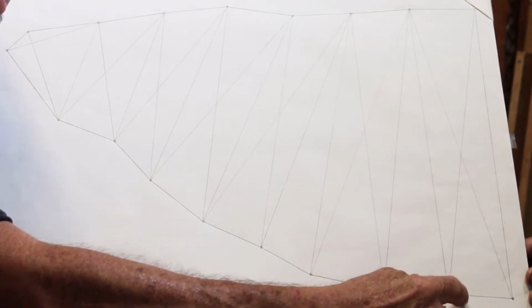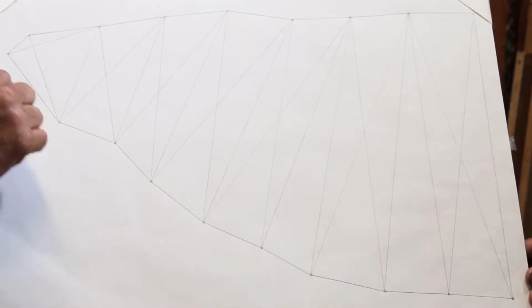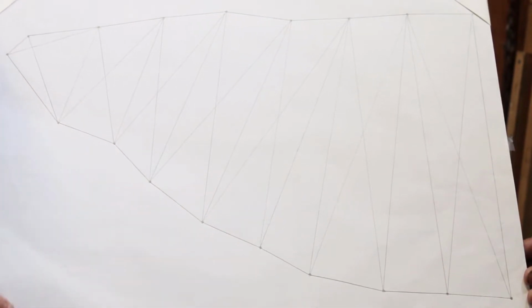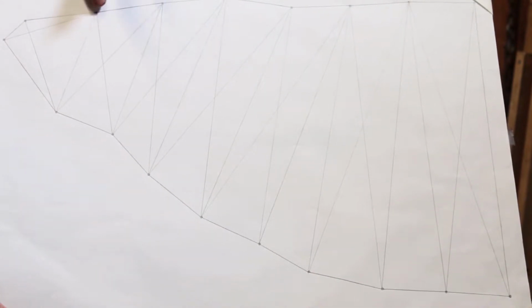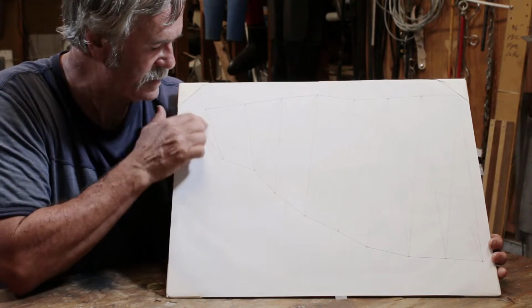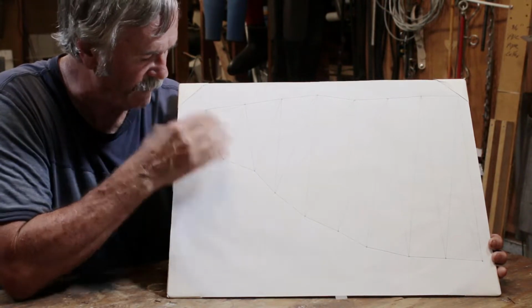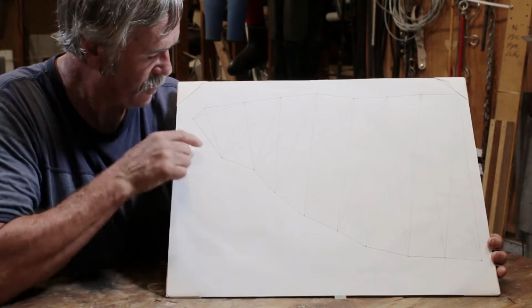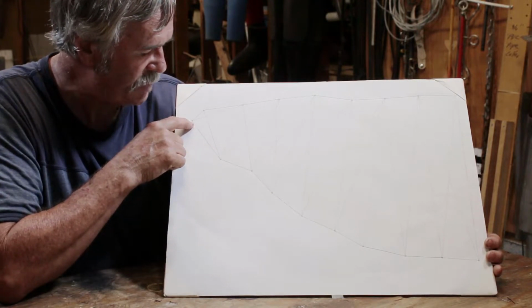So, as I said, you're measuring between each pole along the perimeter. If a pole is in, you have to move the tape line in. Over here, it's the same thing. So we know exactly the distance between each point here. And now you need to know what these distances are here to trilaterate and begin to develop the entire site. So each one of these represents a triangle. I would pull the tape line tight.